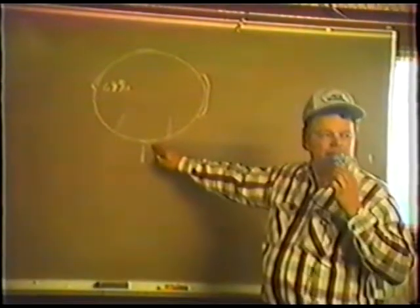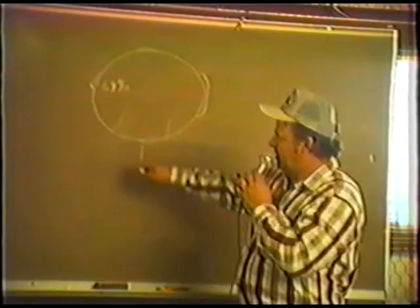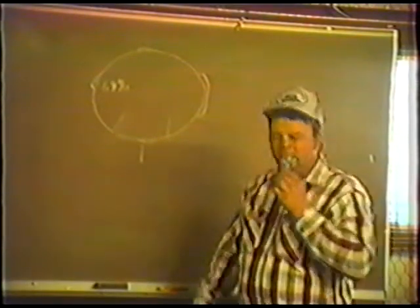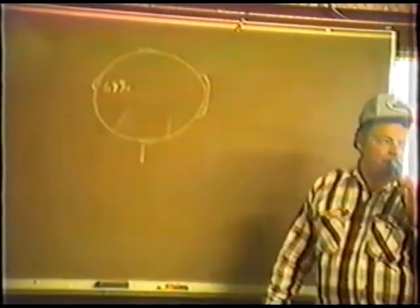We always figure, in our state, we're figuring that it's 100%. We look at where the deterioration is and what it is. Don't be caught with the old cliche of throwing the seam in there, because you're not dealing with the seam. As long as there's pressure down here, don't exceed the design pressure of that vessel — I've got no problem with it running.